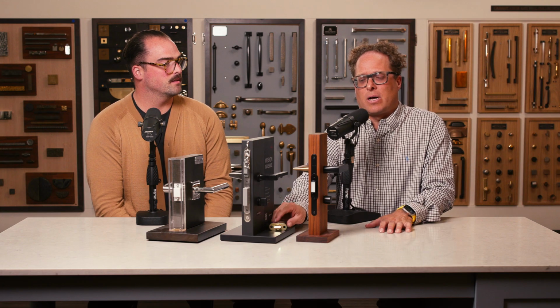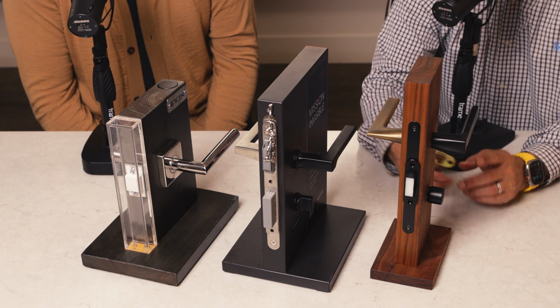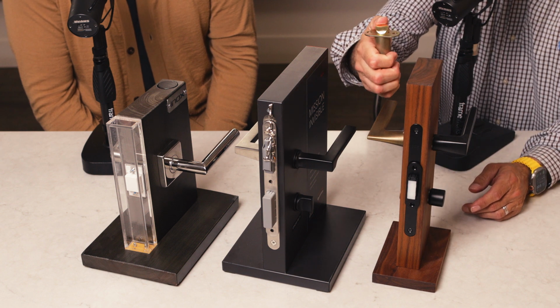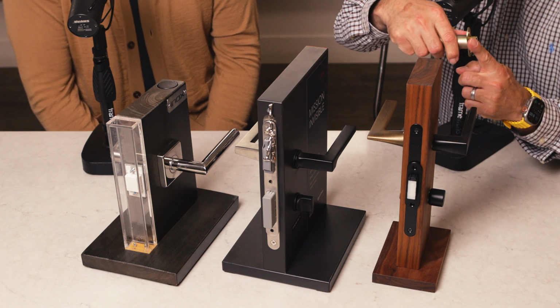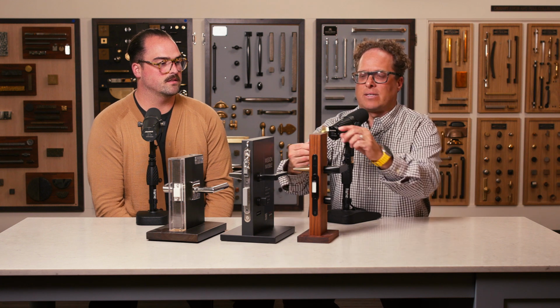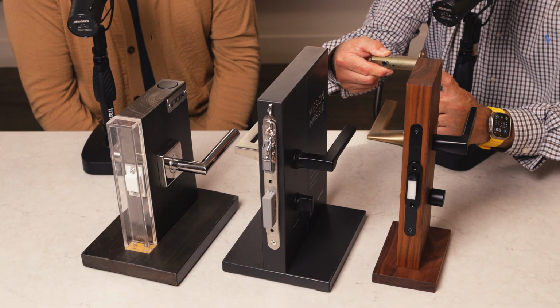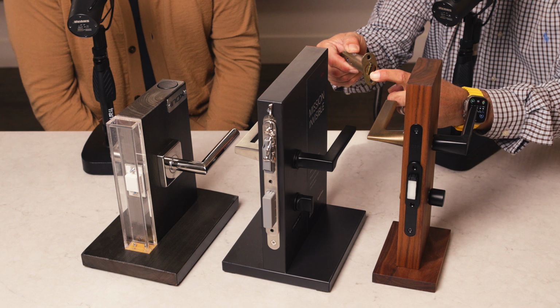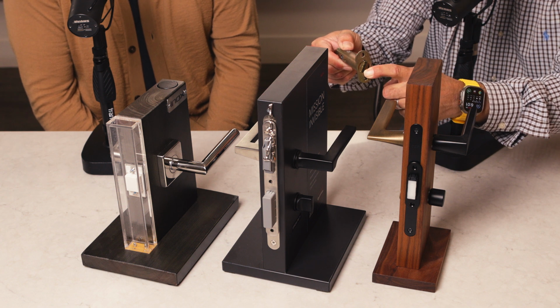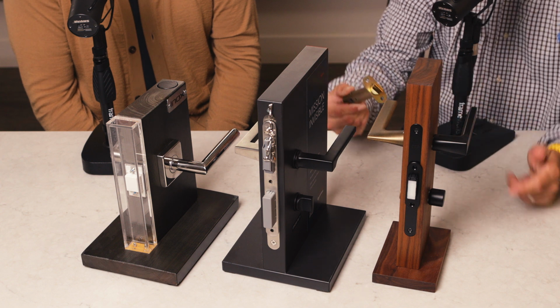So the typical lock that you will generally have seen in Calgary on interior doors has a spring-loaded tongue. The tongue just shoots out with the spring, and as it goes past the strike, it pushes in and then clicks back out. There's a new revolutionary thing that's really taken off lately: instead of having the spring-loaded latch, the latch tongue is held in place by a magnet until it comes into contact with the strike plate, and then a piece in the strike plate will pull that latch out automatically.